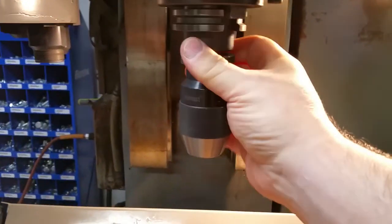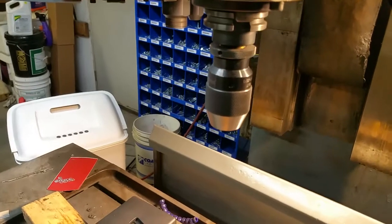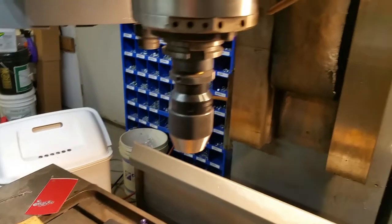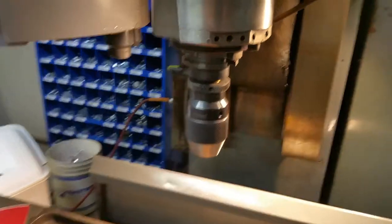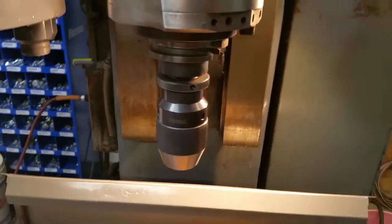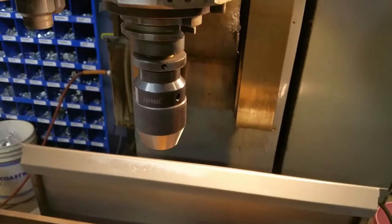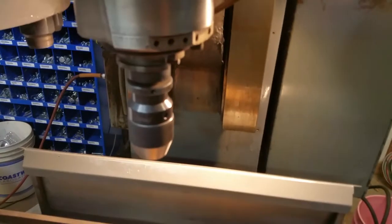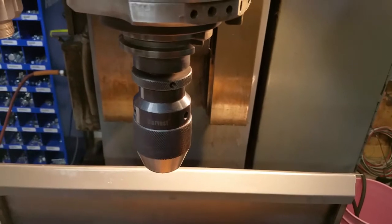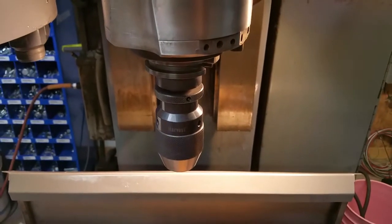Let me get this here and then I'll do an orient. See, it made more than one revolution to orient, because there's a hall sensor on there that senses spindle speed for the orient, and there's a little air-actuated brake roller that rides on there. Sometimes it does more than one revolution. But as you can see, that orient is just perfect now.